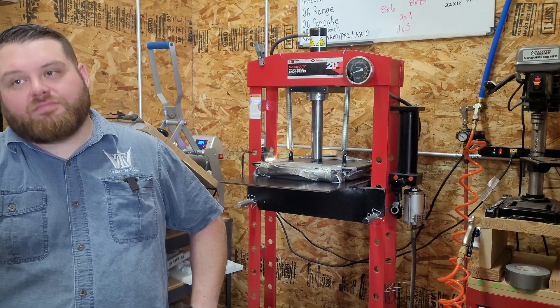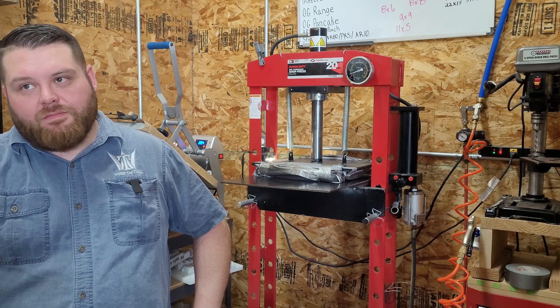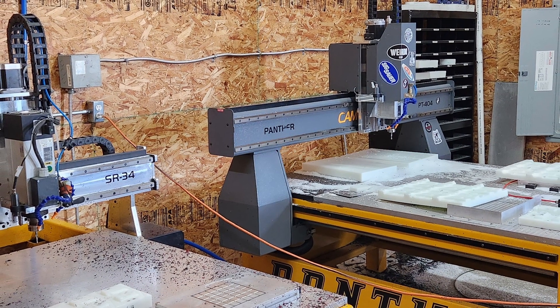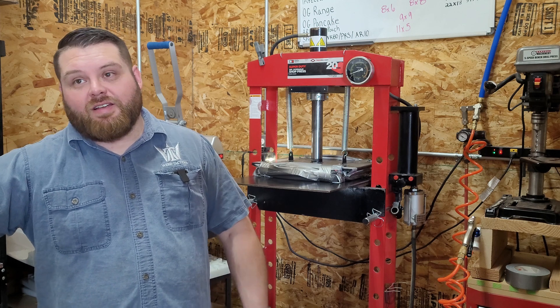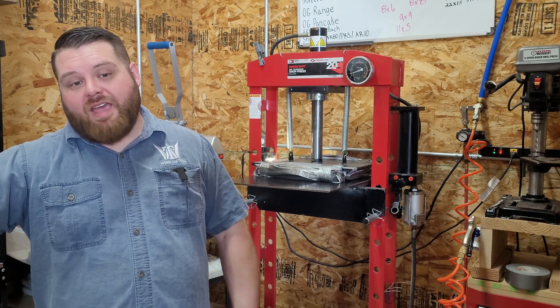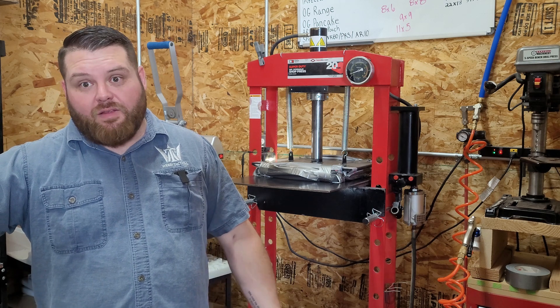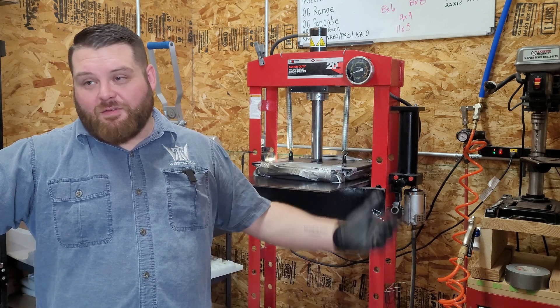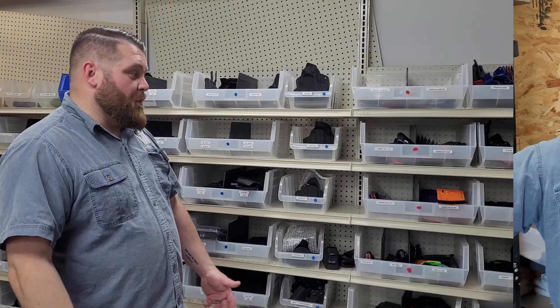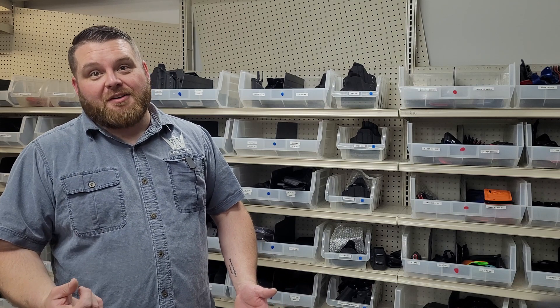You used to have your molds made outside, and now you've taken that under your wing so you can control your destiny by machining your own. Yeah — you remove the wait time and you're not paying spindle time for it. If you're billing spindle time at $400 an hour, that's a savings. Being able to make little tweaks: using a job shop, you make a small tweak in a mold and it might be a month before you get your tool back for just a five-minute change. From a manufacturer's point of view, a good injection mold is going to cost you anywhere from $70,000 to $100,000 per SKU. So considering how many different guns come out every year, speed to market is slow with that approach, versus us — we can cut a tool and be in production in 30 days from start to finish.